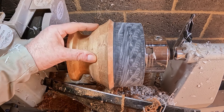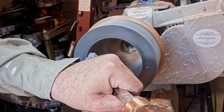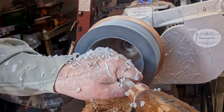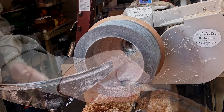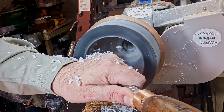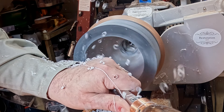So after a final check I removed the tailstock and finished off the inside, thinning the resin sidewall down and blending it into the sapele segments. I had to do this now because once the base was glued on I wouldn't be able to get to it. I sanded just the inside from 80 to 600 grit, continuing up to 3000 grit on the resin.